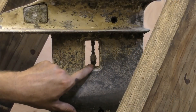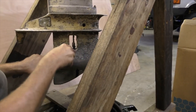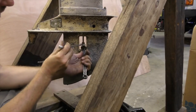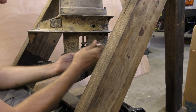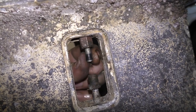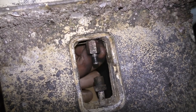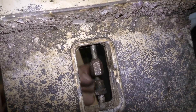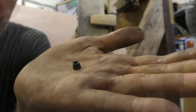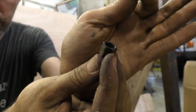This is our shift linkage that we need to undo using a couple of spanners. I'm just going to brush a little bit of this corrosion and barnacles off it. Once you've got this collar undone, you can lift it up and undo this little section here — it's a nylon wedge that stops it coming off, because we need to drop this all the way off to let this rod slide up through the gearbox. This is the little tapered keeper — it splits along one edge so you can open it up and take it off. Once you've got that keeper off, the collar will just slide off.